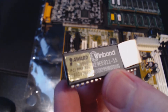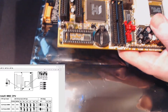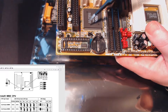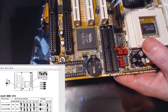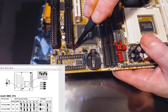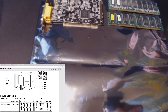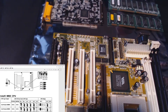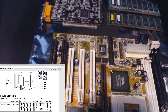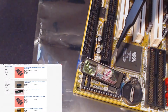I have a little diary where I keep track of everything. I'll write down the BIOS chip name and note that I need to fit a capacitor — C16, 10 microfarad 25 volt — that's the final cap I need to put on the board. I've done all the others. The EEPROM here is discontinued.